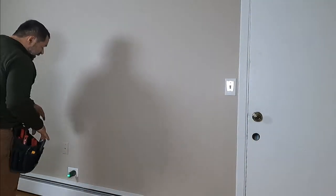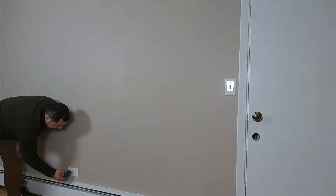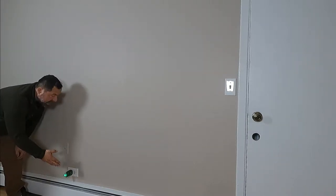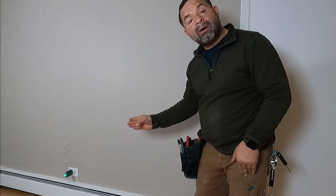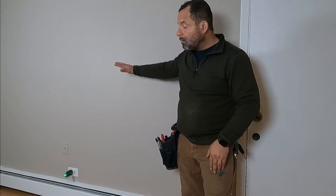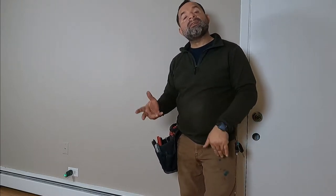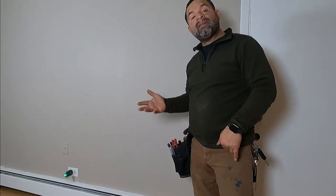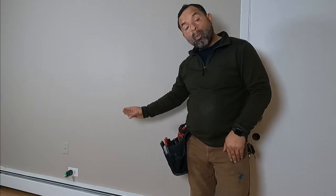See this one — if you plug into the other one here, it's the same. So both sides of the outlets are wired to the same power source. I'm going to show you another scenario that works better if you have constant power in one side of the outlet and the other one is switched. That way if you put your TV on this wall, you want constant power. If the power is switched, then when your son, daughter, or wife comes home and wants to turn the light on, they're going to turn everything off and you'll have to reset your internet, your TV, and everything.